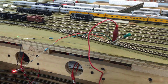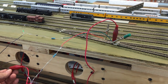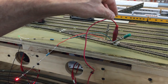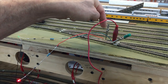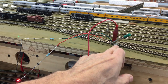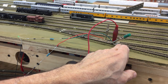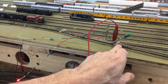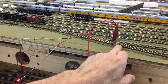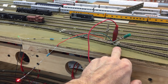The last thing you have to do is take this wire here. It's connected to each of the other legs of the LED, and you connect that one to the output of the frog where it splits. All of my turnouts have a power break after them, just like it discusses in the wiring for DCC. You've got to do that with these Peco Electrofrog turnouts.